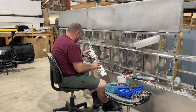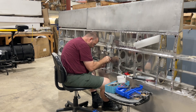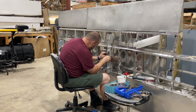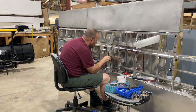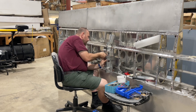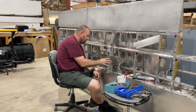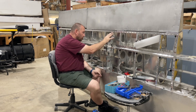Moment of truth — assuming we have a skin right here, the Tornado will be nice because I can stand up to do this rather than laying on the ground. Those bolts should go in and tighten up against the skin. The bottom brackets are done and all set. I'll just need to clean everything up and Uralane glue it down. Now I'm going to work on the upper pieces.